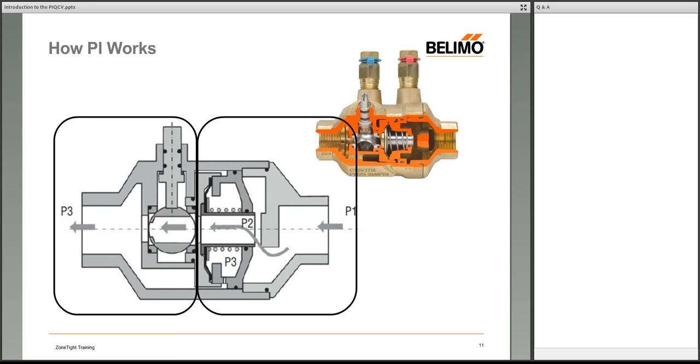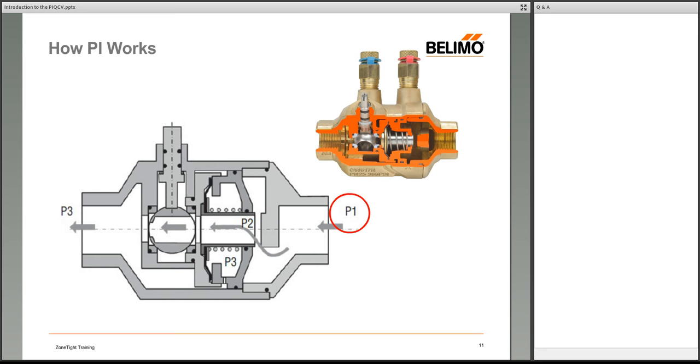P2 is the pressure inside the valve after the effects of the regulator. As water sneaks through the opening before P2, it takes a pressure loss, and we can adjust the amount consumed by making that area larger or smaller. The regulator can move left or right to open or close that area. An animation on the next slide will help visualize how this dynamic process works.